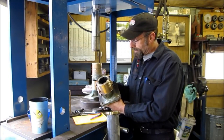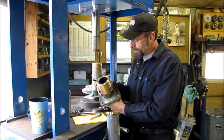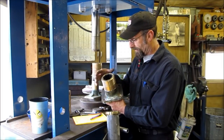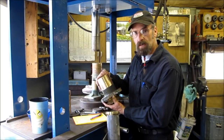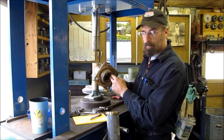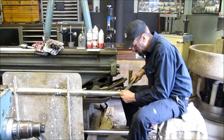Also, we've taken some regular stuffing boxes and we're modifying old packing glands, making them into dripless. What we do is we cut off the flange and we turn this down to a bellows diameter. Give them a couple anti-slip grooves in here, some barbs, and we machine for the bearing. We left it shallow here, left the shoulder, and its stern tube and bearing contact is not interrupted.